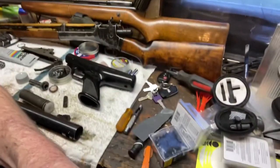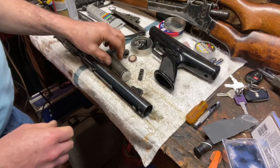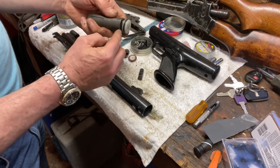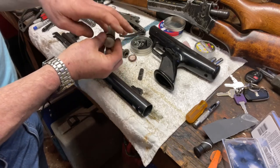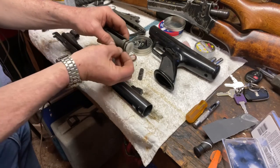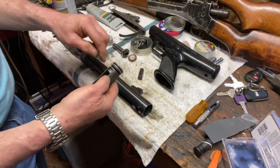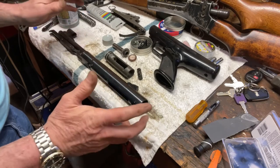So what we're working on here is my BSA Scorpion. Here's the pump cylinder, pump plunger, or whatever you want to call it. It uses a rubber o-ring, and then down on the base it actually had a leather washer around the back side. That was completely disintegrated — it was smooshing out and acting like a brake. It was very gummy and spongy, making it very difficult to pull this plunger out of the tube, the body of the pistol.